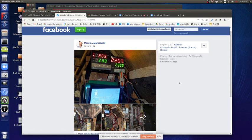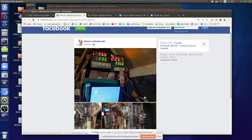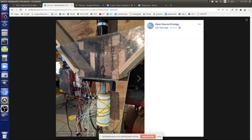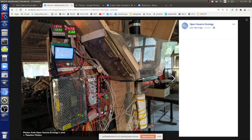What we've got is some issues, like we've got two bands heating the extruder right now, insulated through this little shroud. We've got one band towards the bottom by the nozzle, and one towards a little higher. Is that the third one, or so one and three? Third heating element? What you're pointing out there is the cables to the heating element and also a cable to the thermometer.